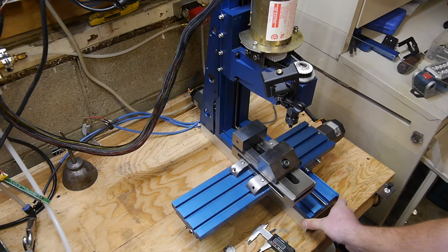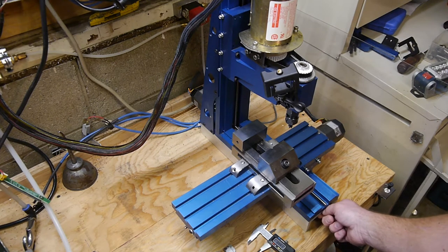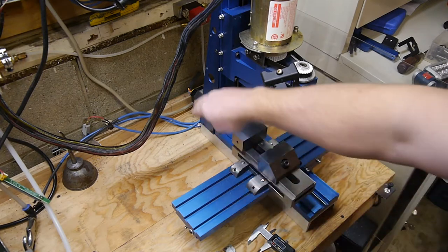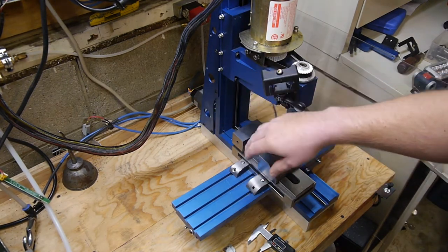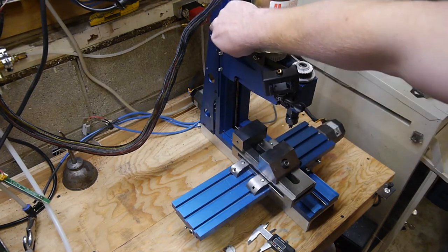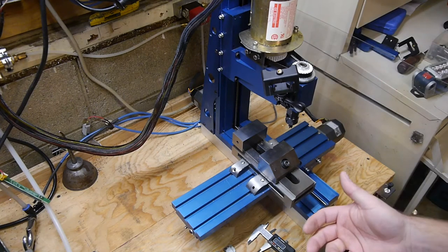That's 4 inches wide, 2.5 inches tall. It's a bit of C-channel with a 3/8 inch web or flange. I can never remember what that's called, but the thickness of this portion here. 16 inches long for the MaxNC 15, probably a little less for anybody else. We still have the stock braces back here installed.